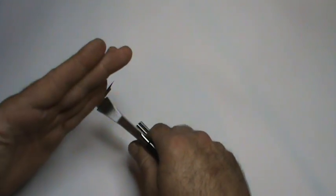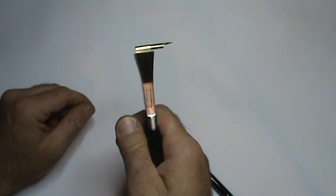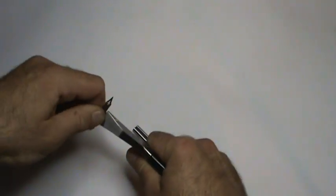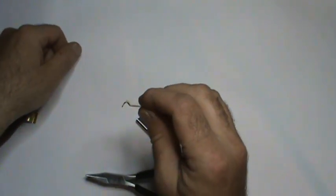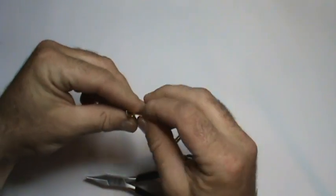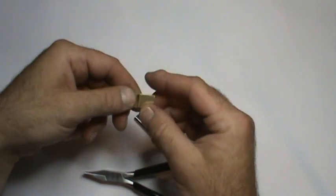And with these being perfectly straight, it allows you to easily look at it and see that you're square with the nib and everything, and you do a quick fold up. Once you're folded up, there's your nib flange shaped. It's ready to go. It's roughly adjusted to an intermediate size nib, and then you cut it, mount it however you normally do.